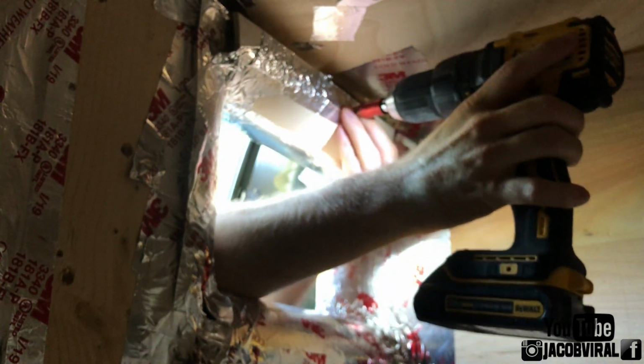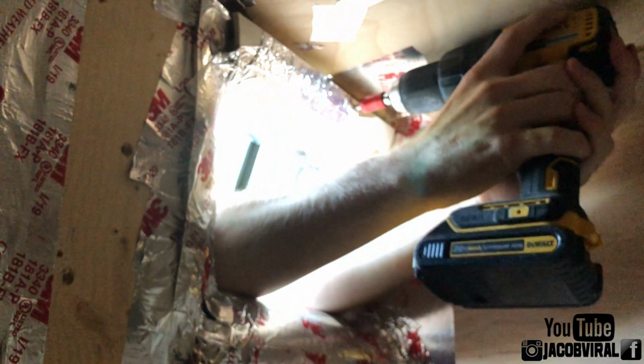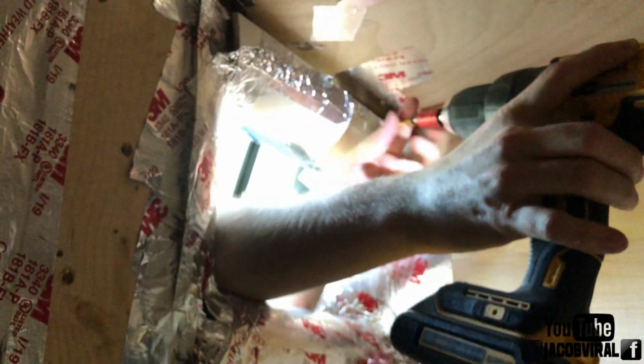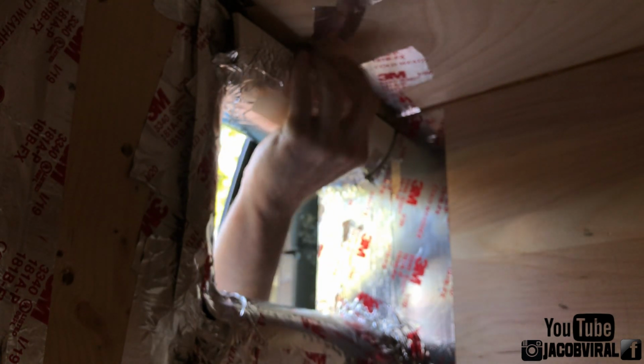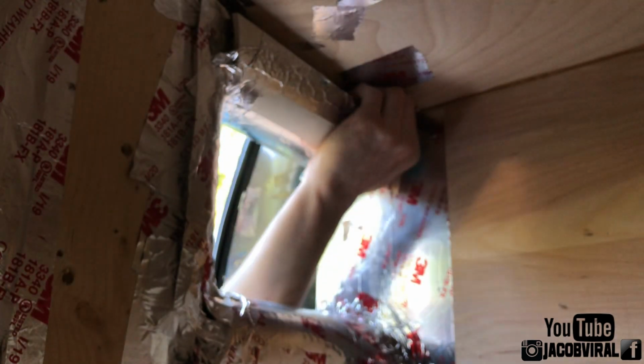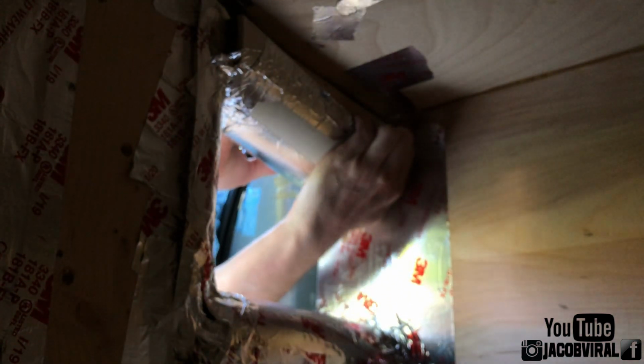Another thing you guys want to consider with port adjustment is if you can design your ported enclosure or your bandpass enclosure around your port with the concept of being able to adjust your port, so you can make it a burp box versus a non-burp box. That's a really brilliant idea. Another thing I've seen people suggest was doing big ports, so aero ports instead of slot ports, because with aero ports you can adjust. Say you wanted to do an 8-inch flare versus a 10-inch flare, and that can adjust to a burp box versus a non-burp, and then you can plug it. So concepts like that.